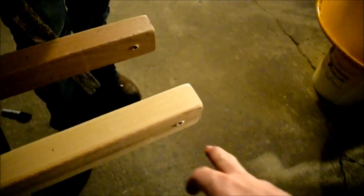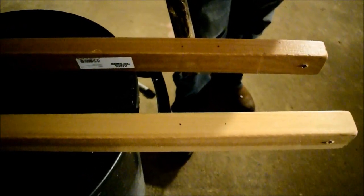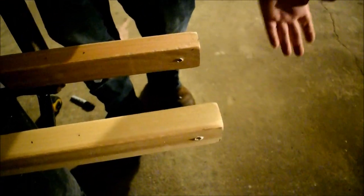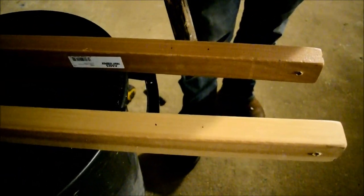As long as the two are the same, you won't notice the difference if it's off an eighth of an inch. These holes we marked by putting that front plate on, kind of putting it to the end. But I like my front plate to sit tight. Every wheelbarrow I've ever run across always has a jiggling front plate that isn't on as tight as it can be, meaning pushed all the way up against the cap and tightened. So we're making it taut.